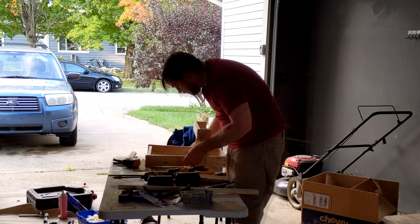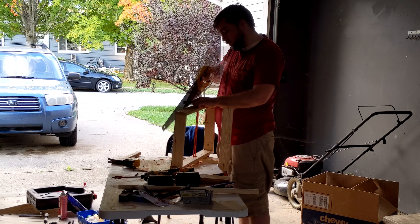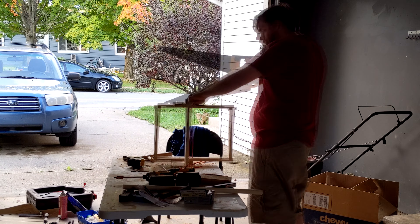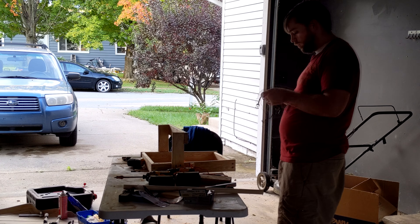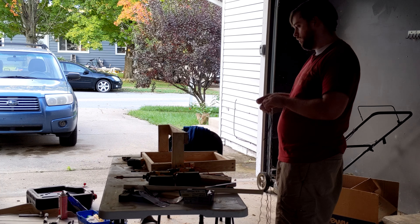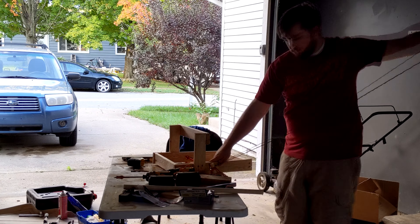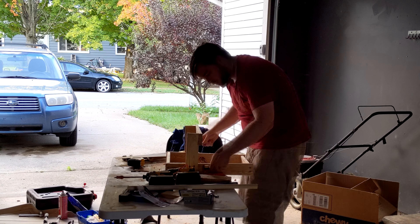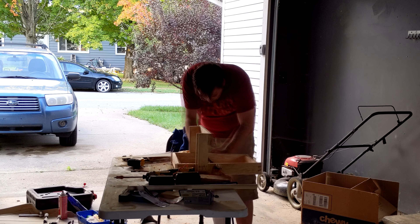The basic parts you'll need for a catapult are a frame that holds everything together and holds the arm. A torsion bundle that can be twisted — that's where you get your power. And then you need your throwing arm, which can have a sling, a cup, or just be flat. If it's too heavy, it won't use the tension properly, and if it's too light, you might snap the throwing arm. I'm building everything out of pine, and there are some problems with that I discovered later on, but for now it did the job.